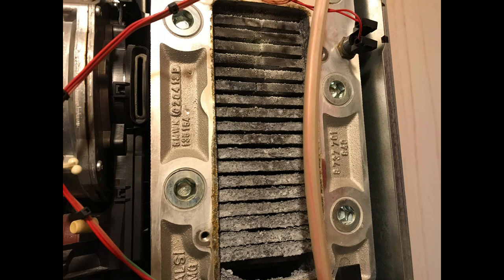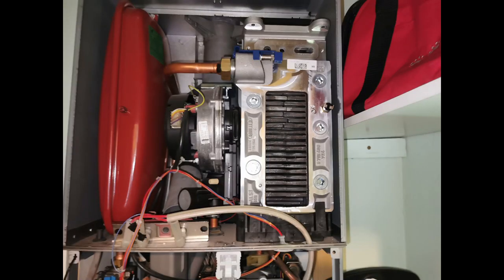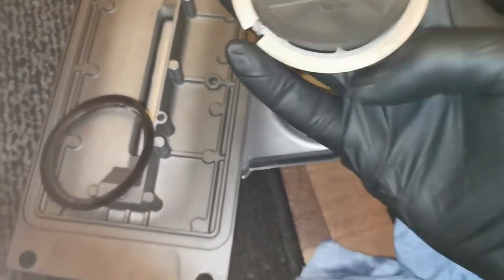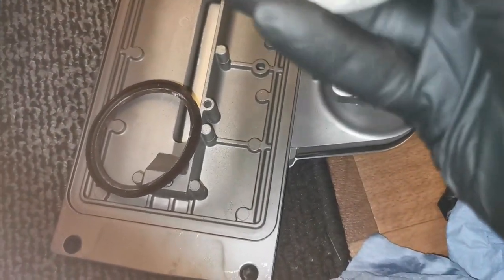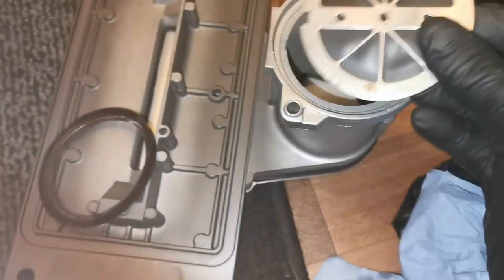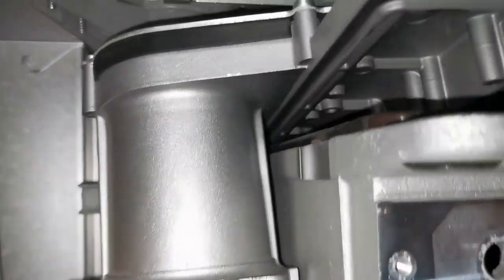Here's a pic of before and after, and also one I've come across which is pretty heavily burnt up. Check the fan diaphragm — make sure there are no splits and it's not sticking. Check all the seals too. If it is sticking a bit, you can use a pencil and go around it to stop it sticking so much, but you might need to replace it in the long run. You'll probably get a smell of gas when it fires up in the boiler if there's an issue.